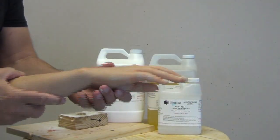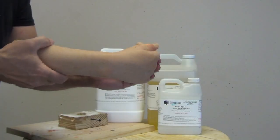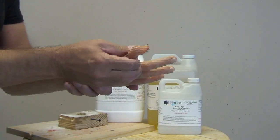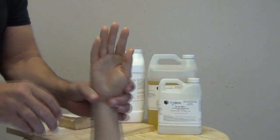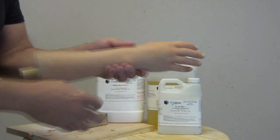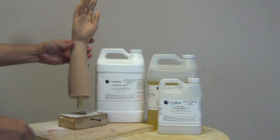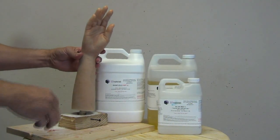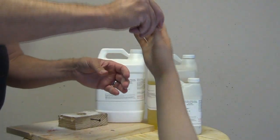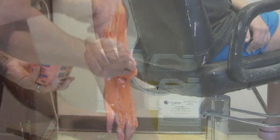SkinFlex 5 is a very strong, tough, but soft polyurethane rubber that's ideal for casting medical simulators and special effects skins and any kind of application where you're simulating human skin, but you need properties of polyurethane, not necessarily a platinum silicone. Because this cures translucent, it can be painted and colored and manipulated much the same as you would a platinum silicone skin material.